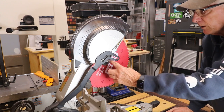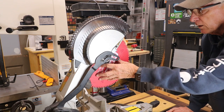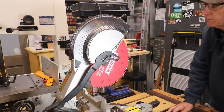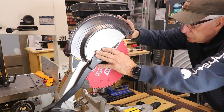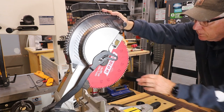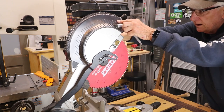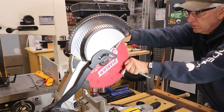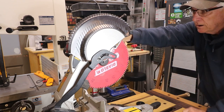We have the problem of reaching this bolt that holds the saw blade in place, so we're trying to get access to that. So I need this to go back. There we go — you can see how that moved back and now it's off of that bolt and that has given me access. This will turn on you, and there's always a blade lock on the back side or somewhere on your saw. This one is back here on the main unit, so I rotate it until I feel that lock into place.